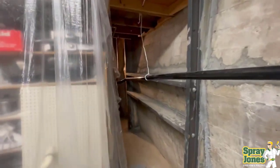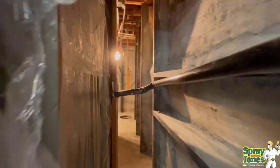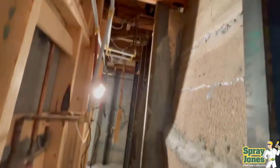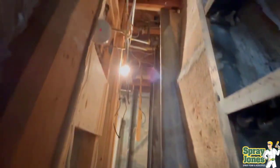You might not see this in your area. We have poor soil conditions where we are — a lot of clay, a lot of water — and that pushes in on the box that a concrete foundation is in the ground. What it does is it starts to buckle and bow in, as you can see on this one. It's pushed the walls right in.